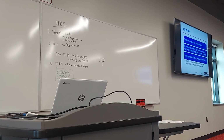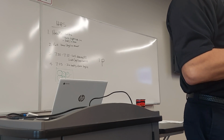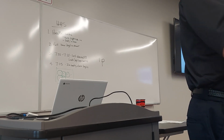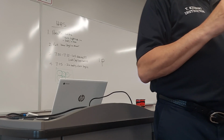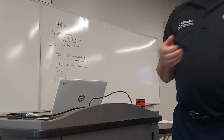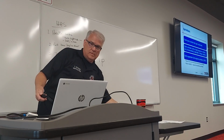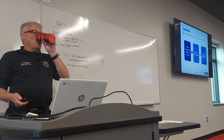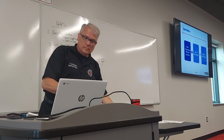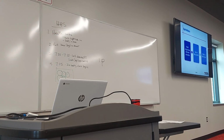All right. So orifice opening. This is designed for a moderate hazard, light hazard. It'll put out 15 gallons-ish per minute. This will put out 100 gallons per minute-ish. So high hazard. Respond to heat, cap or plug open, water is discharged.